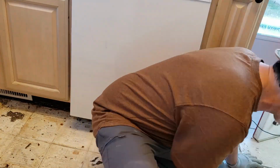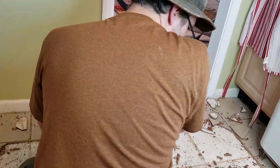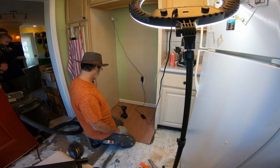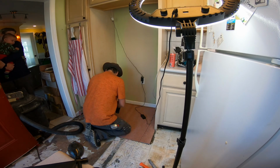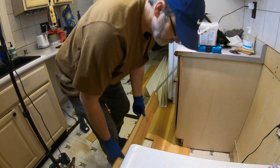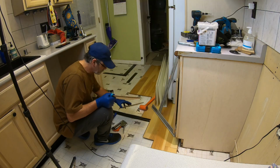So then I had to clean the area out. This is the kitchen area you're looking at. I had to remove all the appliances and get behind all the appliances and see what was going to entail for removing those and getting those out of the way to replace the floor. All my demolition was done here in the kitchen, and there were areas of the floor where the tile board was destroyed, so it had to be replaced in order to give me one even level. You could see in that earlier picture where I had replaced that subfloor to get everything up at the same level.